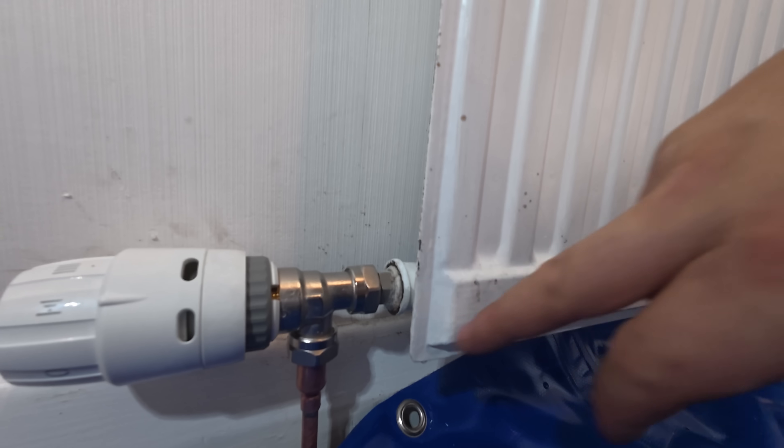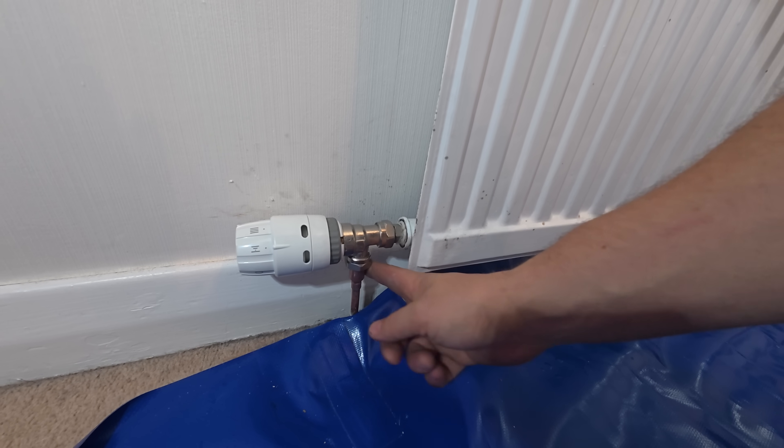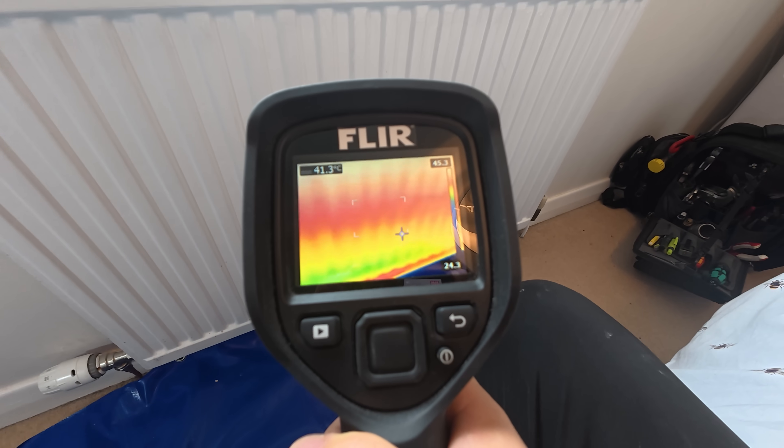It was the radiator valve all along. We first put a hammer to the pin — nine times out of ten they just pop back out, but this one vanished and went straight in. We probably got lucky with no water coming out. If you're going to use a hammer to bounce on the pin, make sure you are ready just in case you get a jet of water flying out. No leaks — looking good. We made the valve tail in with Loctite 55; previously it was boss white and hemp — that's the old method. The compression is on the 15mm, not the 8mm — the last thing you want is to use an 8mm compression fitting as it just crushes the pipe. As you can see with the thermal camera, it's heating up lovely all the way across. If you have a cold spot using one of these cameras, that may indicate you need to flush the system. That's this radiator done — back hot just like the rest of the house. If you liked today's plumbing video, please give it a like, drop a comment below, and subscribe if you're new. I'll see you on the next one.